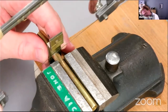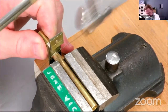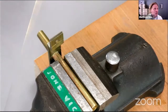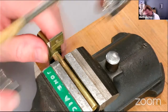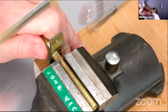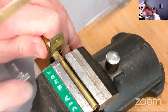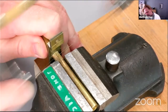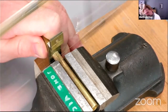So I'm going to cut this off pretty close, which will save us finishing later, but I don't want to cut inside the bridge. Now, just before I actually cut it off, am I doing the right thing here? No, I might leave more material on. It's always easier to cut more off later, isn't it? Yes. And then at least I can run the solder up against the edge. Good idea, Reid. Thank you. This is a really sticky tube brass, drawn brass, which does the job, but it's a bit of a pig to cut.